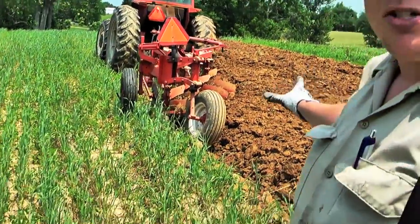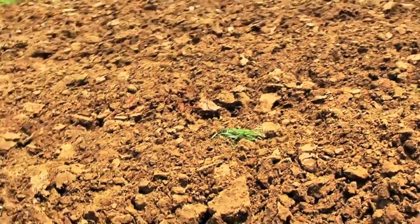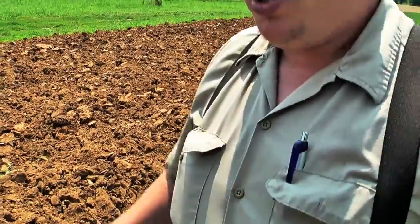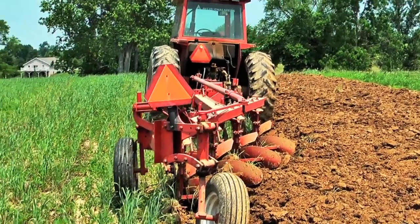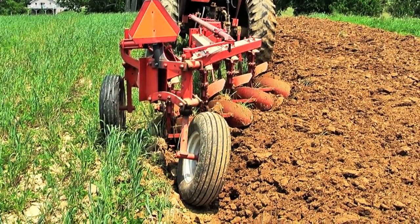Each pass of the plow makes just enough room in this field for two rows of tobacco. Last year this field had 62 rows in it, so I'm going to have to make 30 and a half trips around the field to get it done. I think I've made three or four. It'll take at least two hours to plow this field. I can pull it in fourth gear, but it raises up and down real fast and doesn't do a real good job. So I put it in third gear and as you can see it's level — that's what we want. The plow beam, when I'm using the plow, should be level both across its width and fore and aft. It took several acres and lots of adjusting, but I finally got it set where I need it.